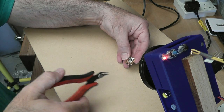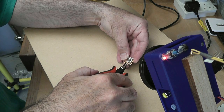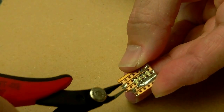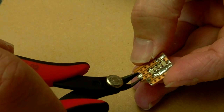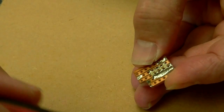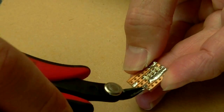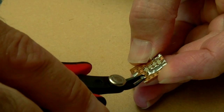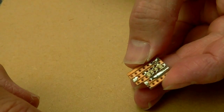So let's see what they can do. Let's have a go at trimming a bit of solder on a piece of stripboard — hopefully you'll be able to see that. I'm going to use these ones, and you can see there's a little bit of solder, a little blob there that I've decided I don't want. So I'm going to take these and trim it, and as you can see, that's taken it almost completely off. Very nice. Obviously there's different ways of removing solder, but I'm just giving you an example. There's another one here which I'm just going to snip. You heard that ping away. It's a very nice way of tidying up your boards.